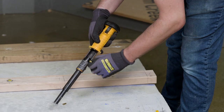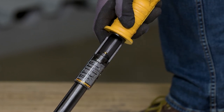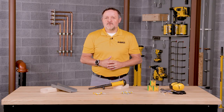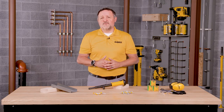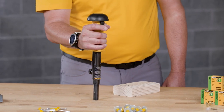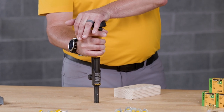Make sure that the breech is clear and insert the powder load, starting with the lowest powder load level. Pull the barrel all the way back to close the tool. Do not attempt to close the tool by inserting force on the front of the nose piece. Also, be sure to never place your fingers or hands over the muzzle bushing. The safest position for your hands and fingers is going to be above the opening of the nose piece on the shaft and handle of the tool.